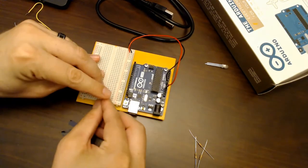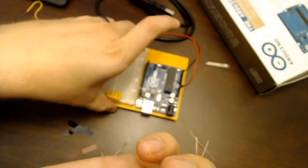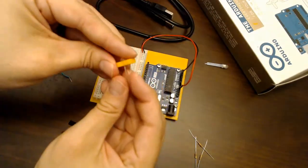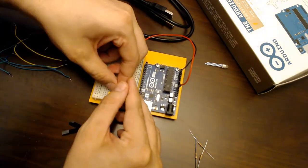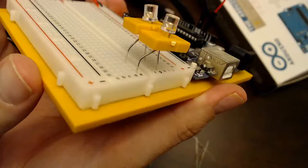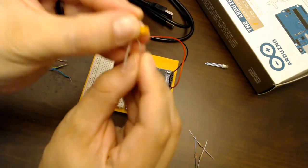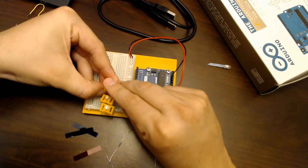After I put my phototransistor through the slit in the light filter frame, I'm going to leave the shorter leg straight and bend the longer leg so that both are the same length. That way when I put it in the board it won't be tilted, and I can easily tell which side is longer because the bent leg is visible underneath the frame. Go ahead and bend one leg and place the phototransistor on the breadboard, straddling the center channel to split both legs.